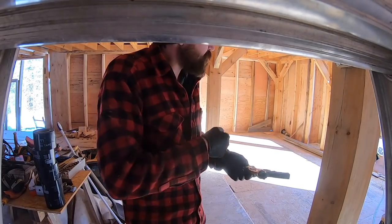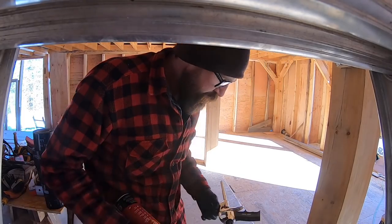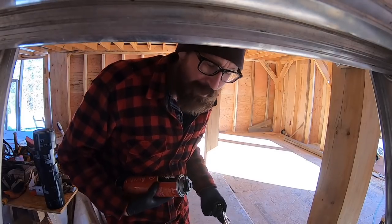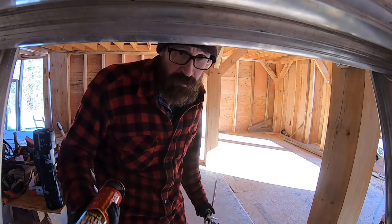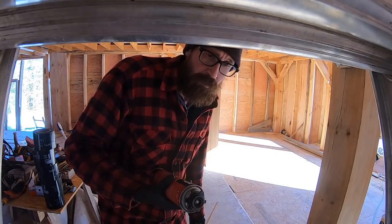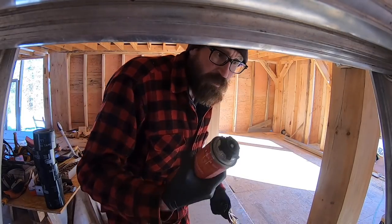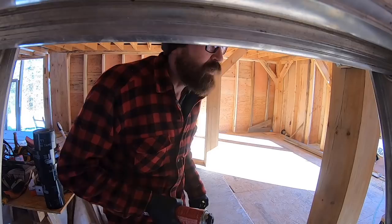So that was some crappy blocking that I had to do. I had to redo a little bit of back work, something I'm famous for here. The blocking that I initially did when I put up the rafters back in '17 was really solid. I put a lot of screws and nails in them because I didn't know better. And it was also 6 inches towards the house more than it needed to be, because at the time I thought the walls were going to be within the timber frame. But last year my friend Martin, the architect, suggested I do this wall system on the outside, almost like a ZIP, completely like an envelope. And as such, the blocking needed to be moved out. So I did that at night the other night with a headlamp, miserable work. And what you just saw was me putting up new blocking.